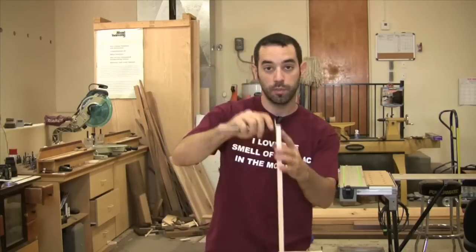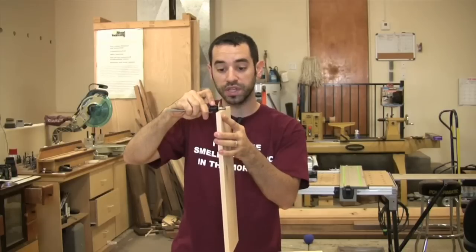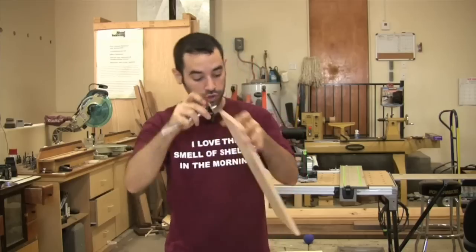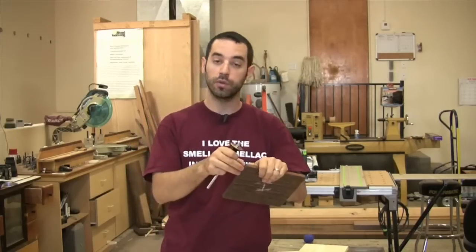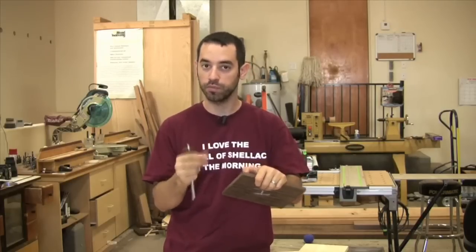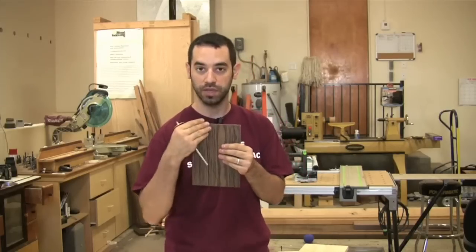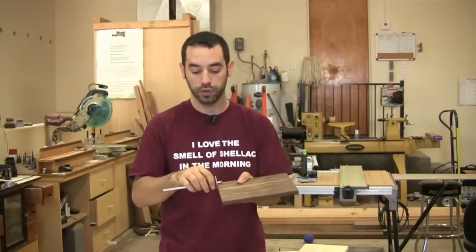I start by using my side piece as reference because I want to know what the exact thickness of that side piece is. And then I'm going to transfer that thickness to my front piece. And I'm really only concerned about the outsides because it's really where the most visible area would be where tear out can occur. And in most cases, that's going to actually be the exit side on the jig. So it's important that we scribe on those locations.